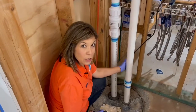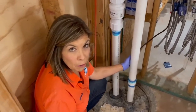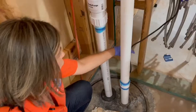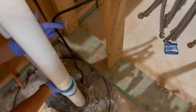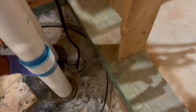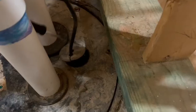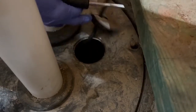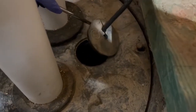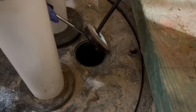What we're going to try to do now is get that toilet paper off the float. Find where your wire goes into the grommet here, and we're just going to take a screwdriver and pull that grommet out, just like so, before we can get either a probe or a broom handle in there.